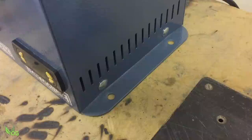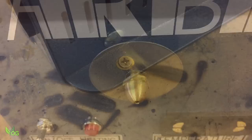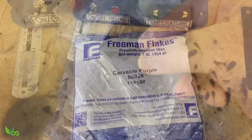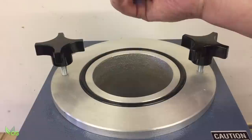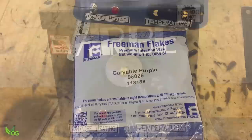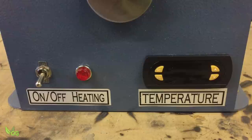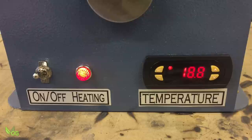Now to test the mould. Arby include fixing points on their injectors — pressure needs to be applied to the injection nozzle to release the wax, so fixing is an absolute must. To use these machines, you really need good quality injection wax, and I went with Freeman's Carvable Purple. These come in flakes which get added to the wax chamber. Each wax tends to have its own ideal working temperature, and Freeman's very kindly failed to include this critical information on their packaging. Plugged in and ready to go, the toggle switch clicks on with positivity and the temperature gauge lights up brightly.